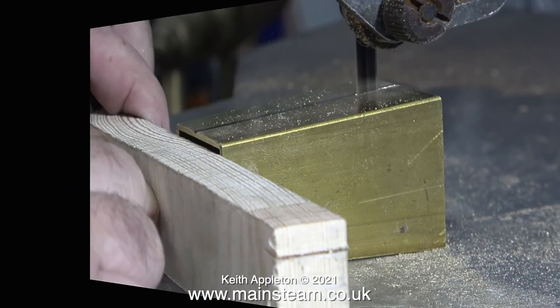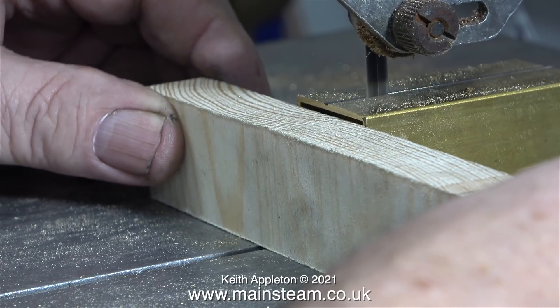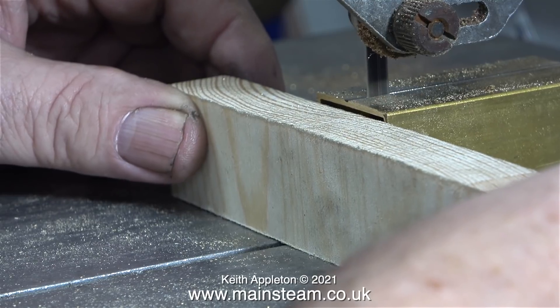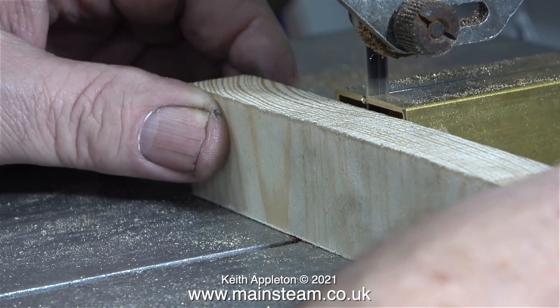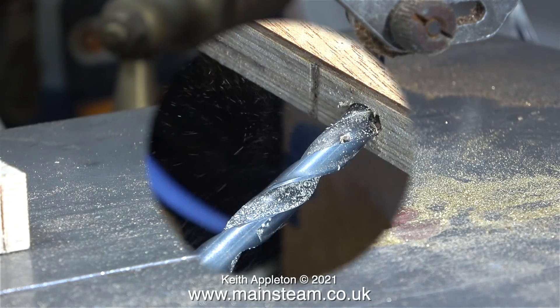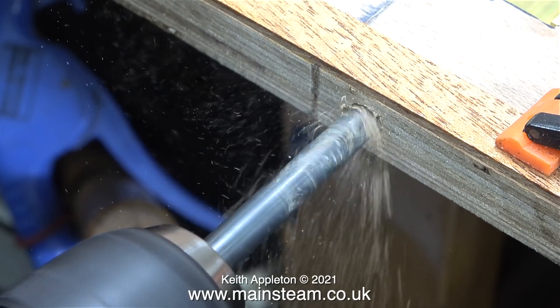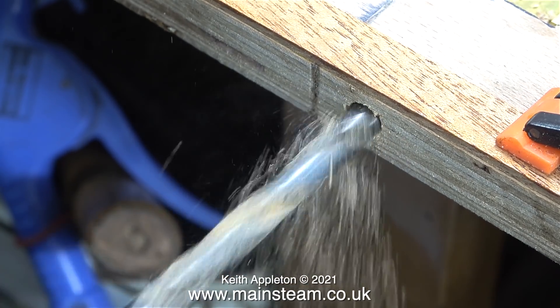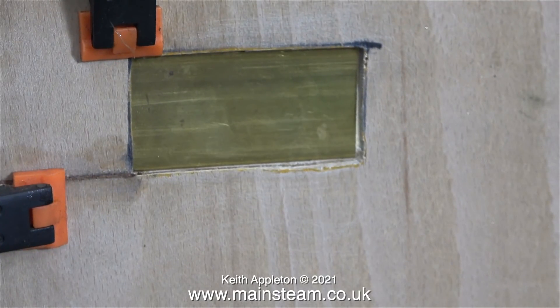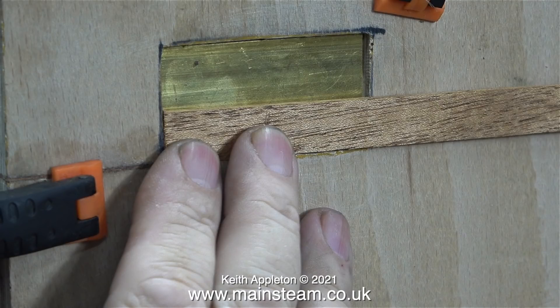For the next part of the job I've marked out this piece of square brass tube and I'm cutting it using the same bandsaw. A bit of health and safety here - I'm using a scrap piece of wood to push the brass through the saw, as the piece of brass gets quite hot after cutting and there's less chance of sawing a finger off. The next part involves clamping a plank on top of the wood so the hole is in the center of the baseboard when finished. I drilled all the way through with one imperial size drill, above 5/16ths. When the steam plant is in use the sump will get quite warm, so the piece of brass box section needs to stick up above the baseboard - I can then plank underneath it to stop heat from damaging any surfaces the baseboard may be sitting on. This is not vital, but I do like to do a good job.